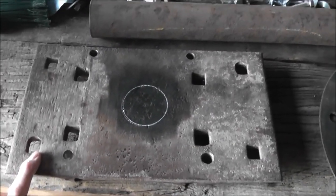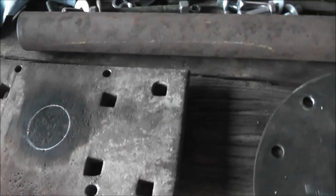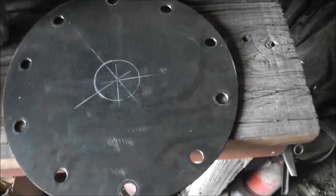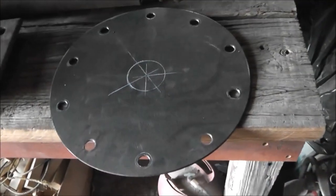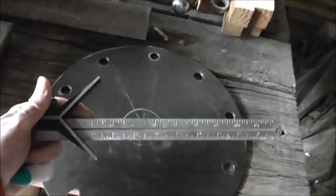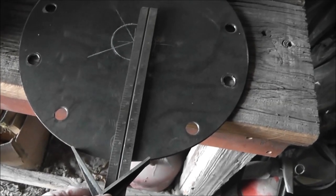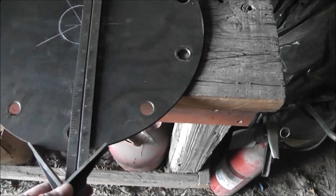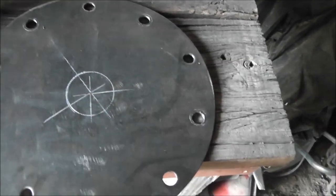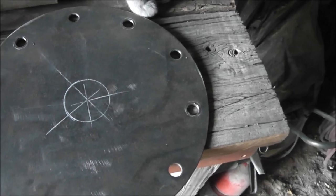To find the center of a square, it's pretty obvious — you just lay a straight edge across, mark your center, then use a center punch and a compass or divider. And on this one I'll show you how I find the center of a circle. I use this tool right here — it's a center finder. They work on any size circle. You simply make a mark this way and then one that way; I actually do three or four, and where they all intersect is the dead center. Then you just make a center punch and use your compass or divider and soapstone.